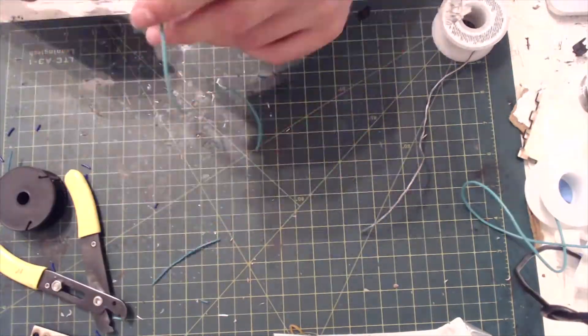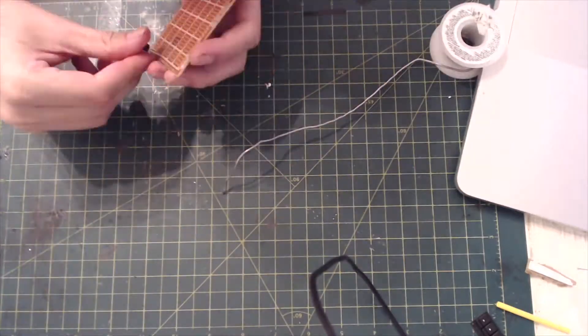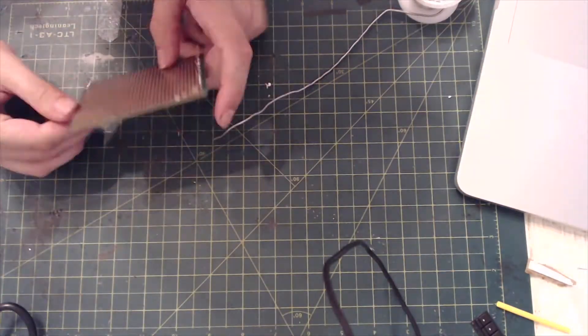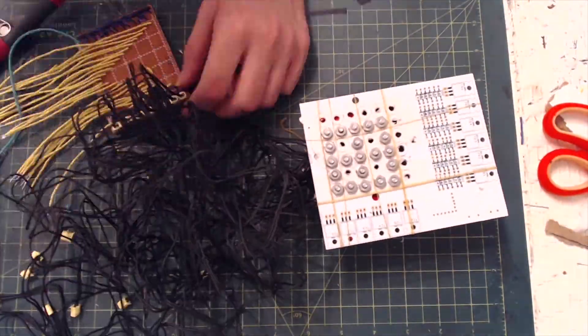The rest of the board is pretty much the same as my previous designs. However, I moved away from MOSFETs to NPN BJTs, because I have much lower current requirements. This makes the boards cheaper and also easier to make a compact design.